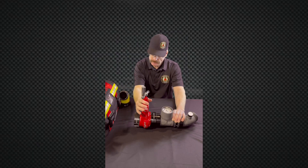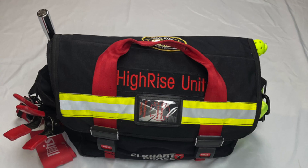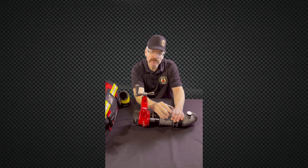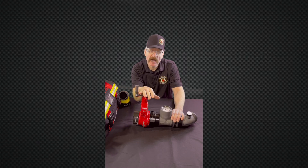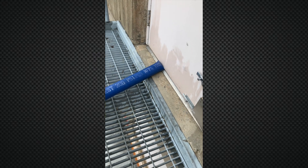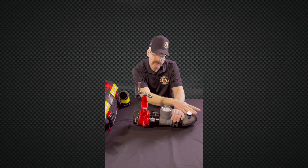We keep it pre-assembled just like this — it fits in our kit, the handle sticks out just a tad and that's okay. We used to have the 45-degree elbow with bleeder off and give the firefighters the option to put it on either side. The problem with that is if we get into trouble where an uncharged hose line gets a door closed onto it and we charge it, we're trapping the nozzle firefighter on one side of the door and the control firefighter on the other side. It's happened to us and it's very difficult to get a hose spanner off static pressure and get that off to bleed the water.